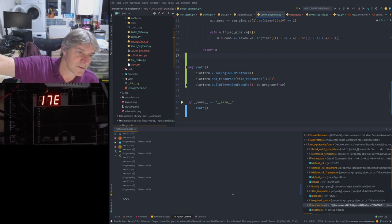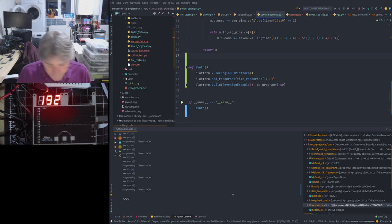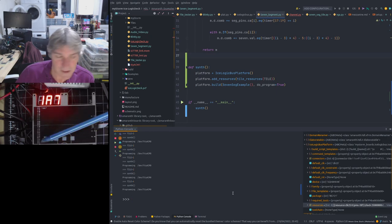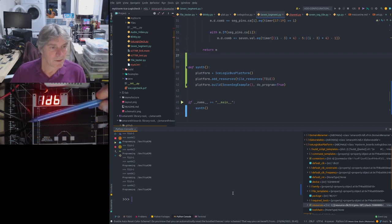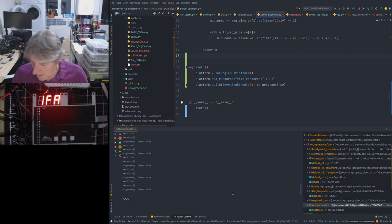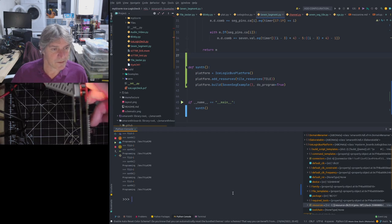I'll remind you, let's just get the light levels up. You can see that they're on the BlackIce board, on the STM32, so they come up from the mezzanine. Then they connect through these connectors here. Now this is a bit ugly and I don't like it, and some of them are in the unstopped areas, which are easy to short. Not only that, the PMOD, which is underneath here, sandwiched in between the ICE logic bus and the STM32 board, the BlackIce NXT board, means that it's actually slightly difficult to get to.